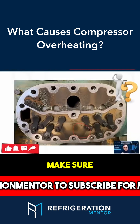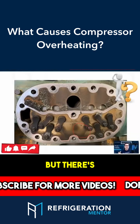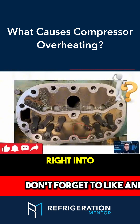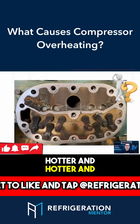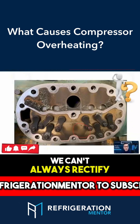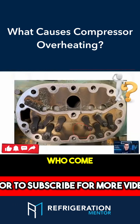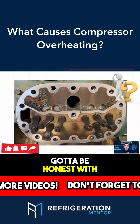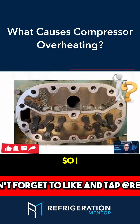You want to make sure to dive into what caused the overheat. Because you can say overheat, but we just said six or seven things could be the issue. Someone could install that unit right into where there's a bunch of walls and you're recirculating that air, so the air gets hotter and hotter. All these little different things that we need to understand. Sometimes we can't always rectify it without a big cost, because if you're the service technician who comes to a customer to help them out and somebody else installed the job in the wrong location, you've got to be honest with them — show them and talk to them about what needs to be done and why this is happening.